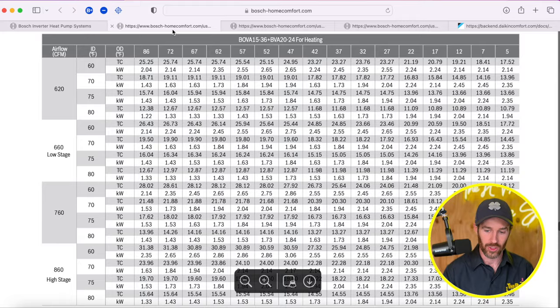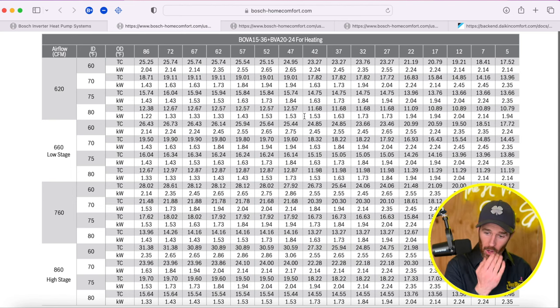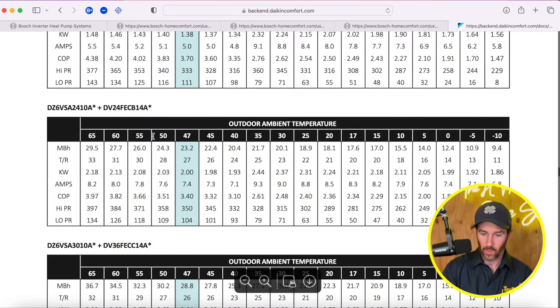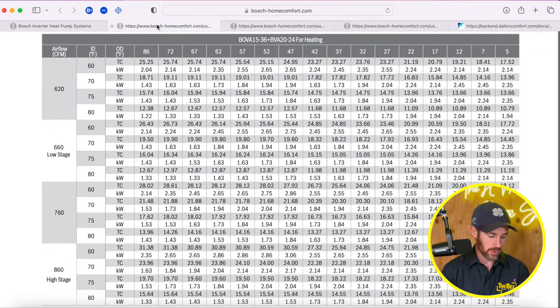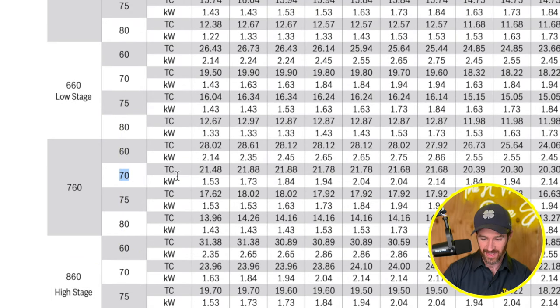I did some pre-calculations to give you an apples-to-apples comparison. To keep things neck and neck across the other videos on the channel covering the 15 SEER, 18 SEER, and 20 SEER systems, we're doing this on the two-ton model — same thing for the Daikin Fit Enhanced two-ton model. On the side where it says 760, that's our airflow in CFM — cubic feet per minute. This is the indoor temperature or set point. This column shows kilowatts used, and TC stands for total capacity in thousands of BTUs.